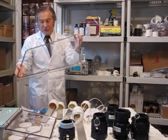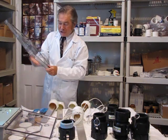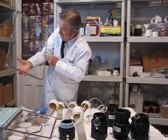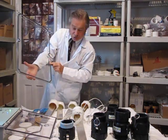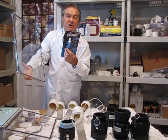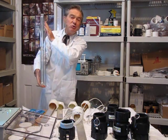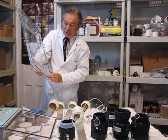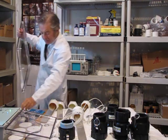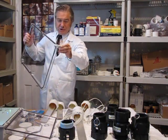The transparent lid fits on tightly. It's supposed to be waterproof and it has a gasket — an elastomeric rubber gasket — all the way around. I wouldn't rely on this totally, which is why I supply this plumber's cement, a rubberized cement, to augment and reinforce the sealing. You don't want any leaks, so put plenty of that on.